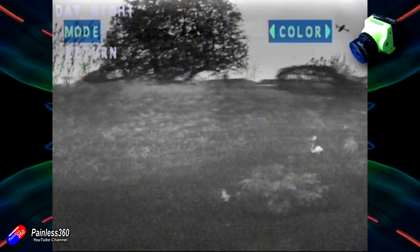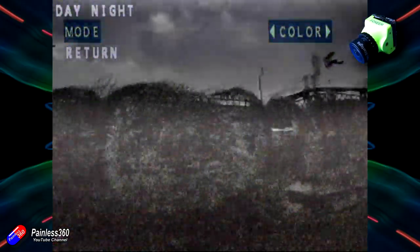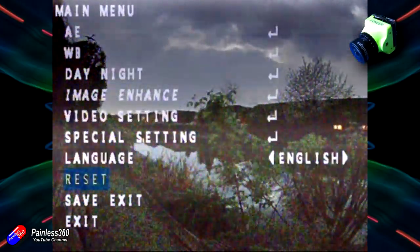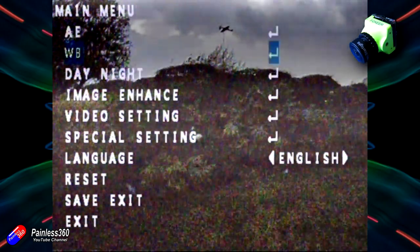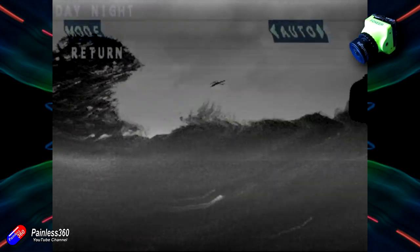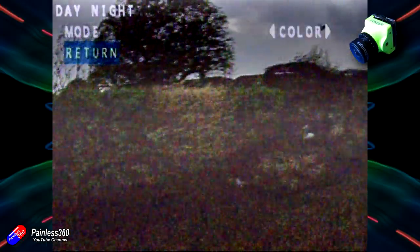However, the Nano micro camera was a little bit different. I struggled with this — I tried it with both a 5V supply and a main battery supply. When set to colour it's still performing well, though not as good in my humble opinion, probably because the lens is a little smaller. The problem I've got is that if I put it into automatic or force it into black and white mode, we get these really weird old-school Doctor Who CRT-type artifacts. Whereas in colour mode it performs an awful lot better.